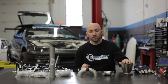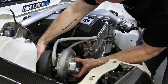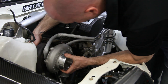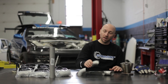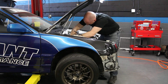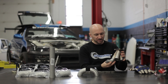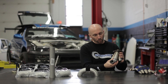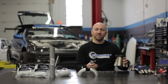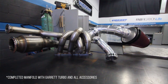The first step in starting my turbo manifold is I'm gonna take my collector and I'm gonna bolt it to my turbo. I'm gonna take that as an assembly and I'm gonna hold it inside the engine bay where I think it's gonna live. I want to take a couple of weld elbows and my head flange, put my head flange on the engine, and kind of hold these in place. I might need another set of hands to position up maybe one elbow on the head flange and give myself a visualization as to how that first runner is gonna travel from my head flange to my collector.